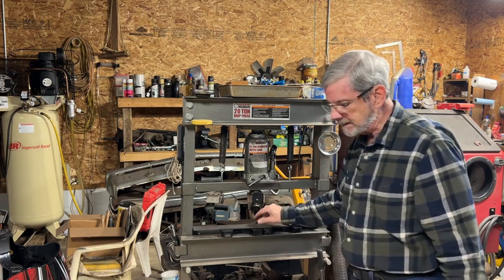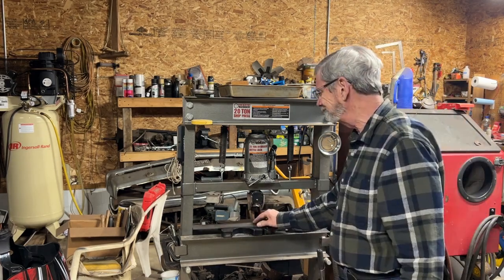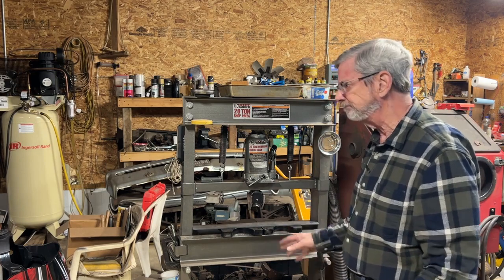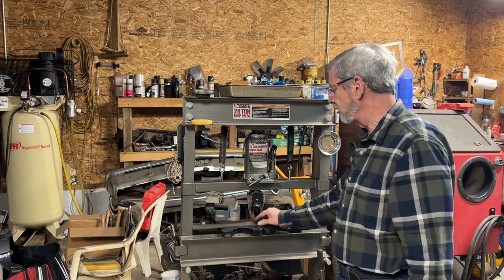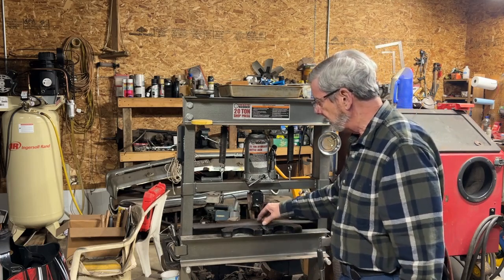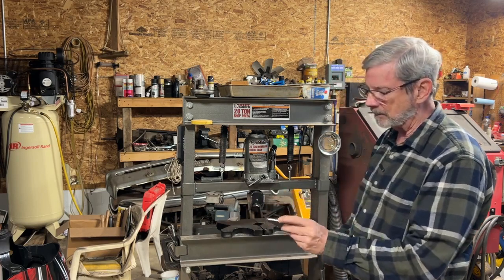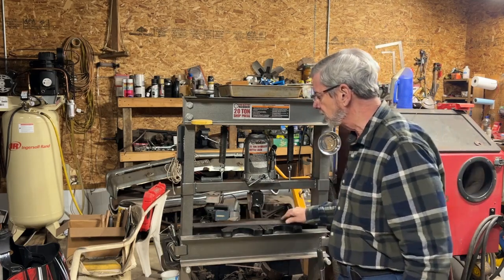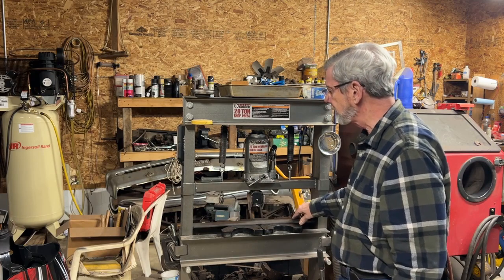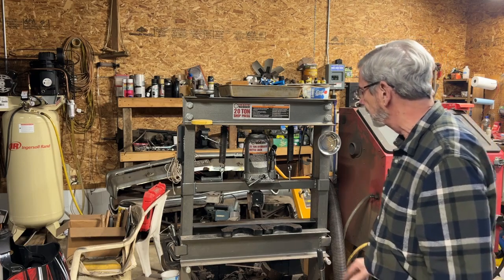I'm using 1/4-inch stock this time. I used 3/16 last time, and it warped and it was okay, but it was borderline. And this is going to be longer, so I went with 1/4-inch this time, and rounded the edges just a little bit, just so that I don't have a sharp edge catching that side piece here and catching the paint as I go in. It'll get scratched up eventually probably, but I'm not too worried about that. You can always find more paint.